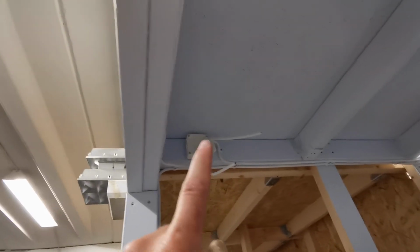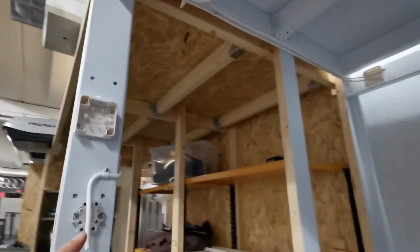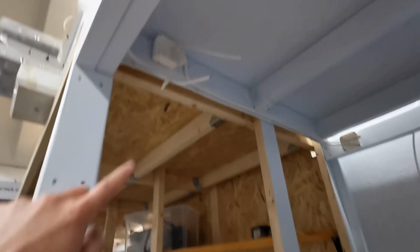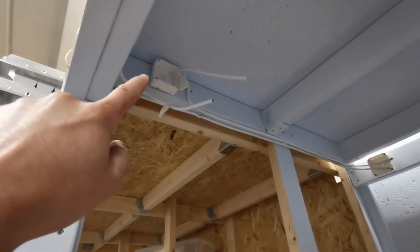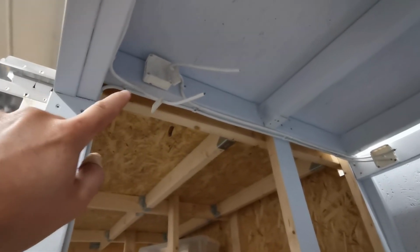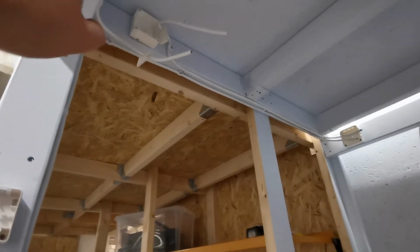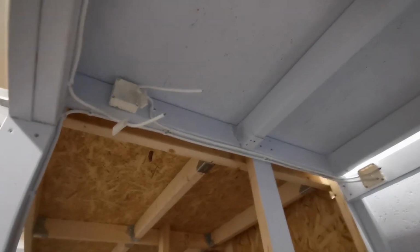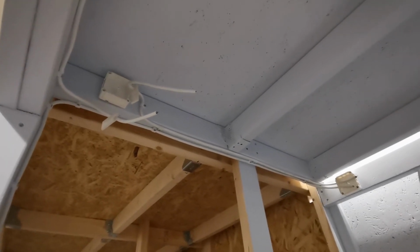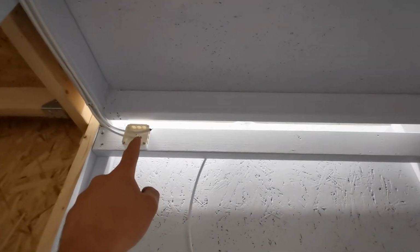And then also, the second cable coming from the first junction box goes down here and then to this outlet. And from the light junction box I need to buy another cable with 5 strands going down to this switch. Then I will have a breaker for the phase wire, and then I will run a third cable from the first box all the way over there, and then to the rest of the system.